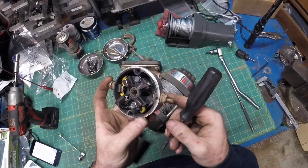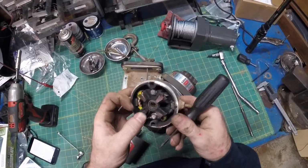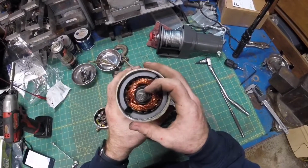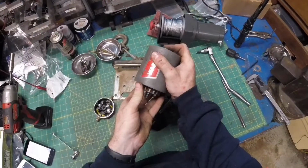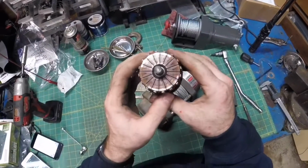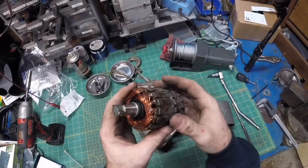I'm equally disappointed in the weatherproofing, but maybe I'm just overestimating the power of water intrusion. Bigger springs, too. The armature has a double D shaft instead of splines. It's cheaper and easier to manufacture that way, but you get fewer indexing options, so score one Harbor Freight. However, see how these windings are all epoxied? And also, see how clean these commutator bars are after a quarter-century of use? Yeah, this motor's going to last forever. Not sure I can say the same for the Badland.